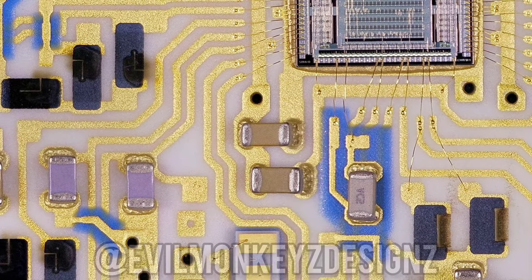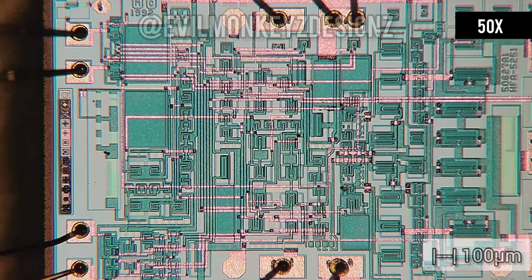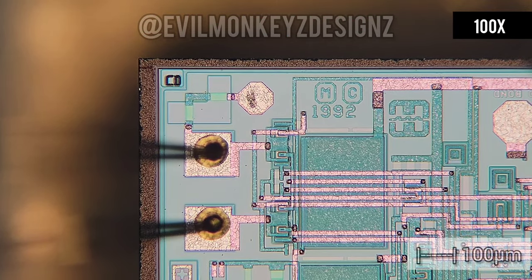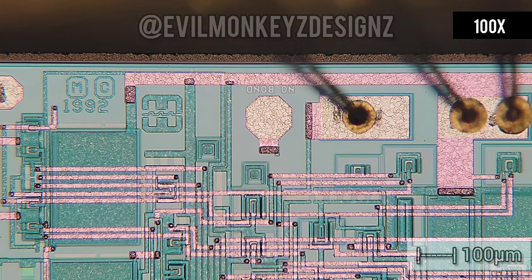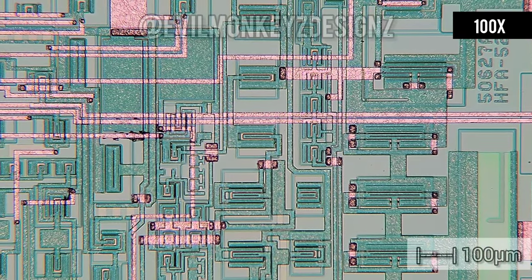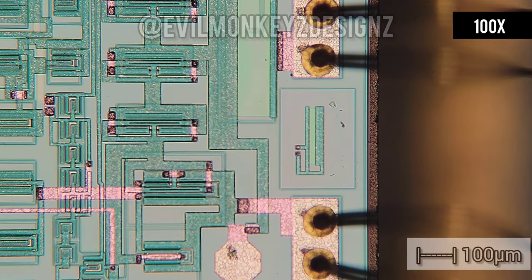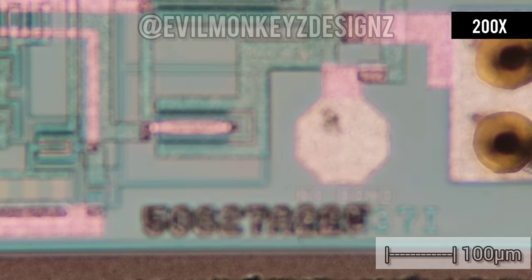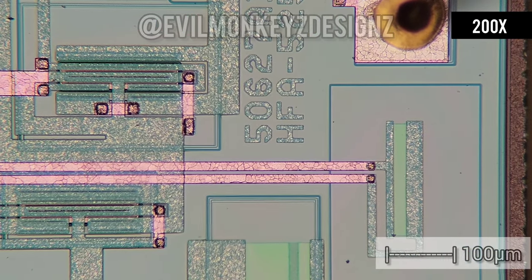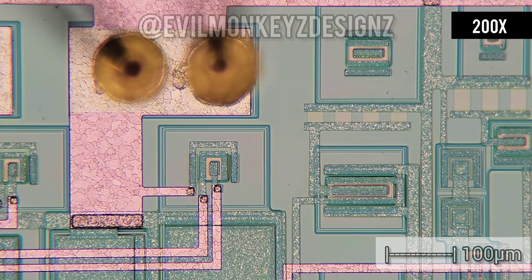Below this chip is a chip from Harris Semiconductor, and it is perhaps my favorite of them all because of its colors. This chip has a mask works and copyright date of 1992 and includes numbers 5062-7A1, HFA-5251, and 5062-7A225 — which looks like it's written over some other numbers. This chip contains many laser-trimmed resistors along with pads that say 'no bond' next to them, and plenty of unused circuit elements. Unlike the other parts, this part number actually led to a match: according to the datasheet, the HFA-5251 is an 800MHz monolithic pin driver manufactured using a proprietary complementary bipolar UHF-1 process. I've included a link to the datasheet in the description.